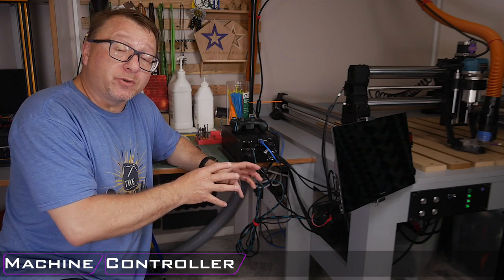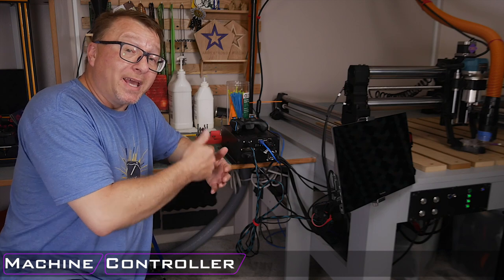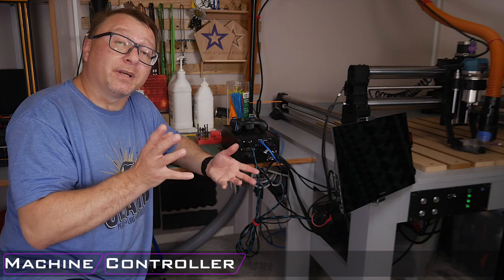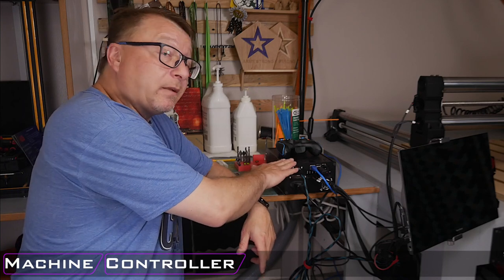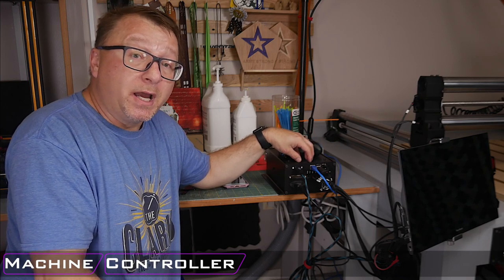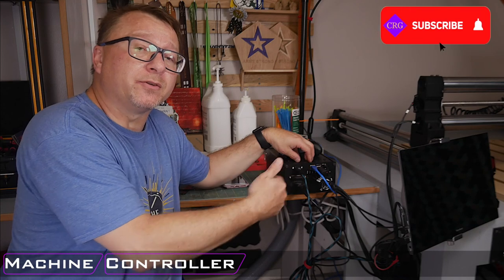What those types of controllers do is they simply interpret your G-code and then send that to the motors and control your machine. Something has to send the G-code to those controllers, and that is usually a computer. And that middle tier is really something like the controller from the Onefinity system here, which actually has a built-in Raspberry Pi, so that serves as the computer, so you don't have to have a computer tethered to your machine